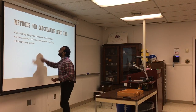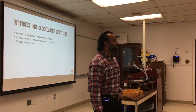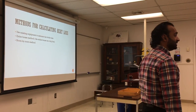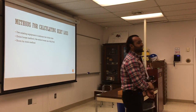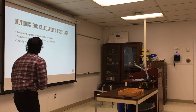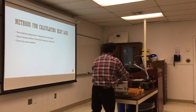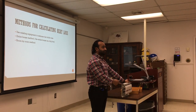The first method is the easiest: you find what boiler was installed in the house and pick the same exact one. You see how many BTUs it was and just put the same BTUs — whether it's enough or not. That's the easiest way to do it, but it's the most inefficient. It wouldn't take too long to verify that the boiler is enough. Another approach — if the boiler was not functioning properly — is to go to every room with a measuring tape and measure all the radiators.